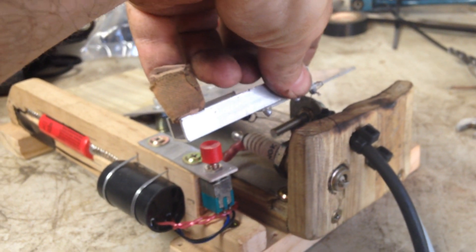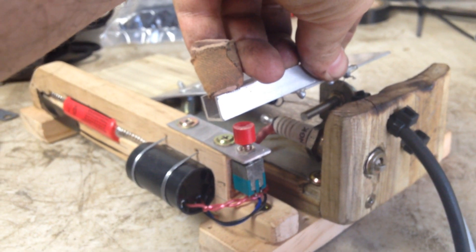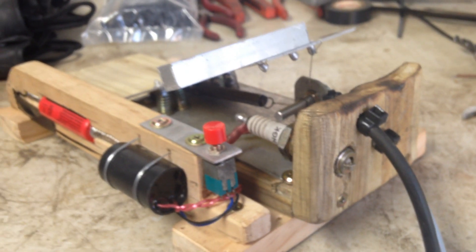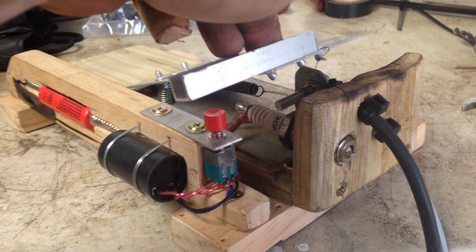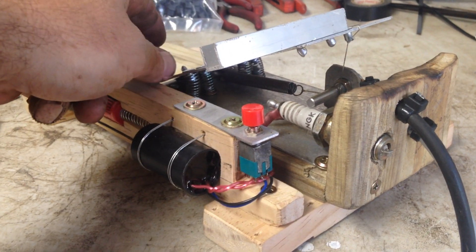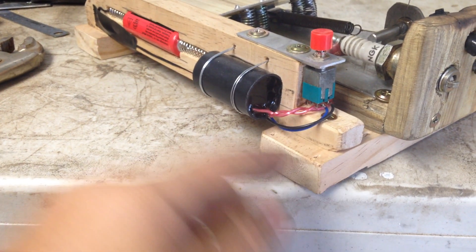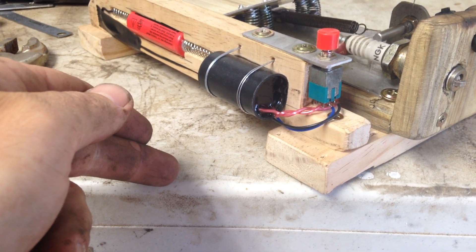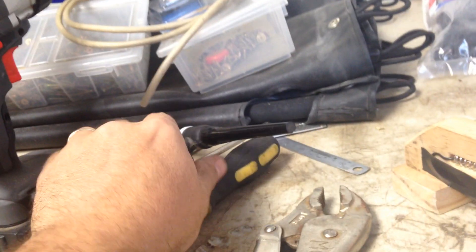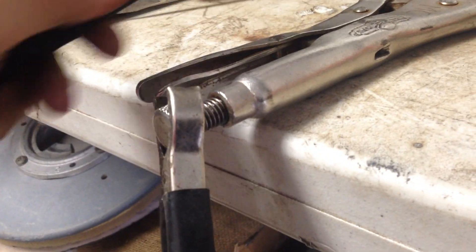So when you push it, you can go to full noise and then — you get your high voltage arc start up and then you can back off and vary the amperage as you go. I've yet to put a micro switch in to actually shut the voltage off completely, but at the moment I just strike off really quick, keep the argon on that spot just for a few seconds, and then turn the actual gas valve off. So that's good — I'm getting a decent little arc across, wherever the job is.